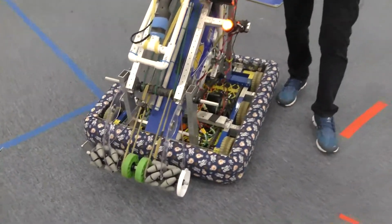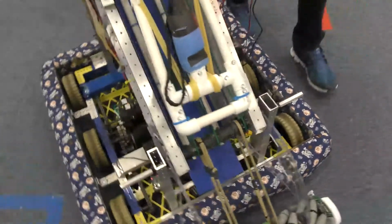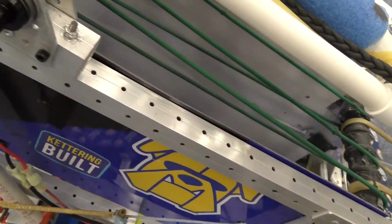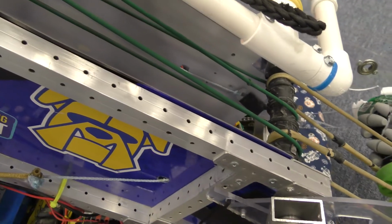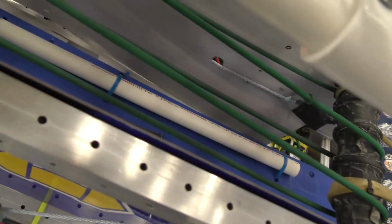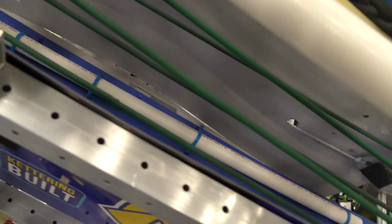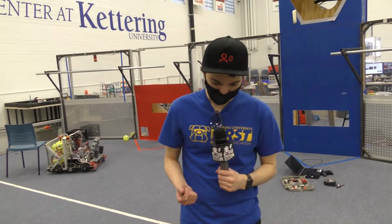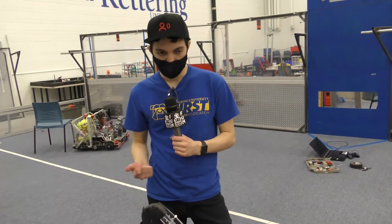One of the other changes that we would make on our robot is that our belt system in the middle doesn't have a lot of contact with the balls as they come through. As you can see, the two on the sides are pushed all the way out, and that's because they just don't provide anything and they have tanglement issues at the bottom. What I would recommend is swapping out this middle belt with something wider. Some polyurethane would be a good choice. There's plenty of options on McMaster-Carr.